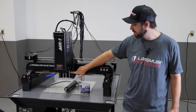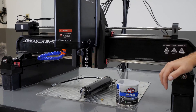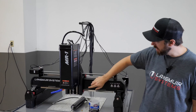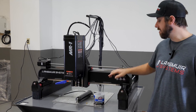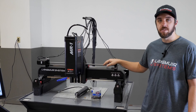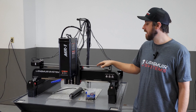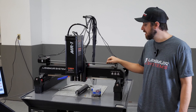For the lead screw on the Z-axis — which is not a ball screw, but a regular Acme lead screw on this machine — it's done the same way. Jog the Z-axis all the way up to expose about four inches of lead screw, apply grease to that exposed section, then jog the Z-axis down into that area to work the grease up into the lead nut. This will optimize performance and keep the Z-axis lead screw lubricated.